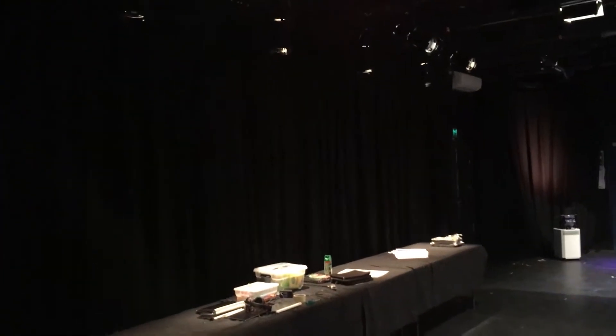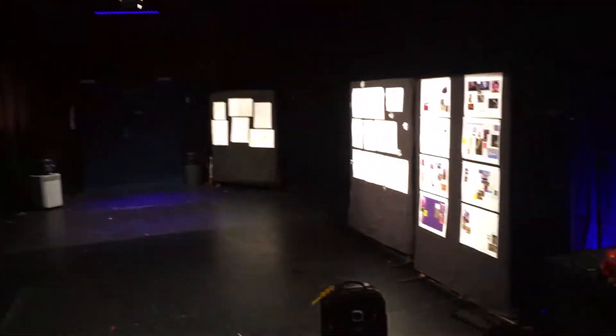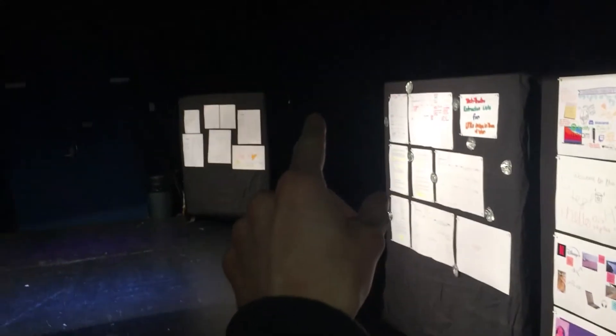I'm very happy with my first lighting design project. The sound is hooked up into only one speaker — there are two speakers in this room up behind the curtains but only the right one works for some reason, I cannot figure out how the left one works. The main out comes out of here and goes into the wall into a patch point that goes to the amplifiers upstairs, which run cables down into the speakers.